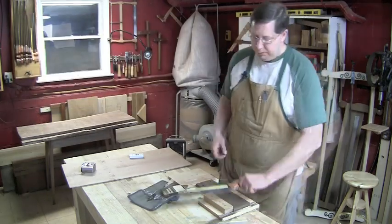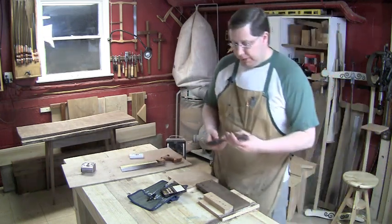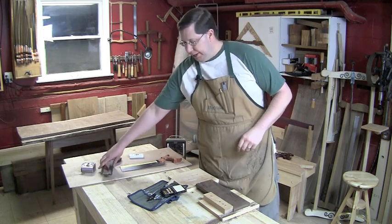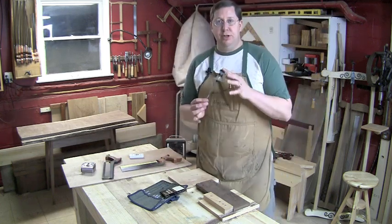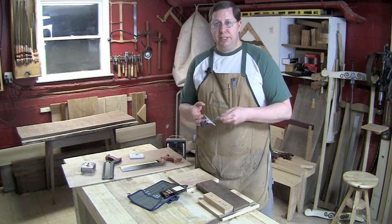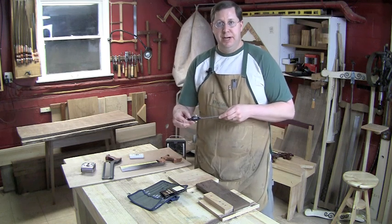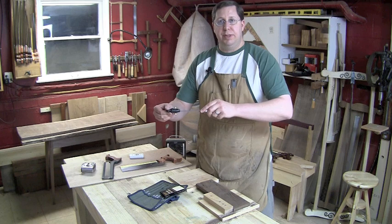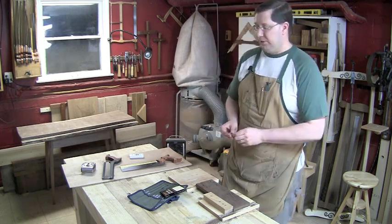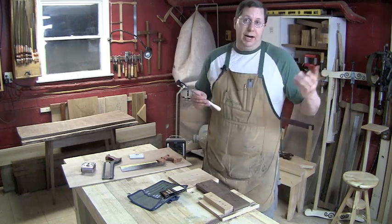Love it. So I've got basically a brand new carcass saw and what I think is a much better performing dovetail saw. I'll send this back to my buddy Sean. And really, it's made dirt simple with this little saw filing guide. Again, as you saw, it's not actually pushing your file in one direction or another, but it gives you plenty of reference points. Every time you stroke forward with the file, you can check your rake angle and your fleam angle, and you end up with a very consistent saw. And the proof is in the pudding. You saw how well these saws cut, and I'm really happy with it.